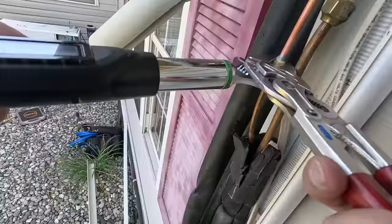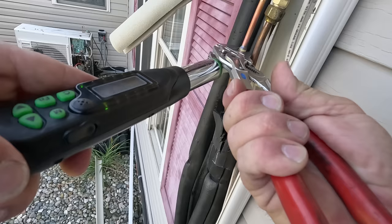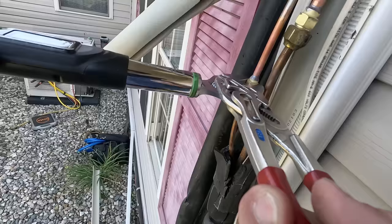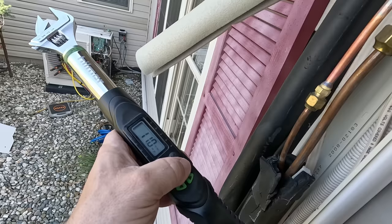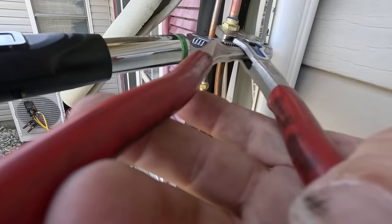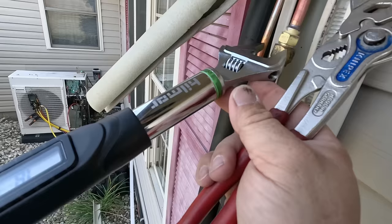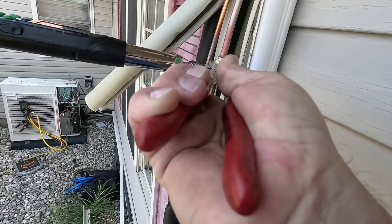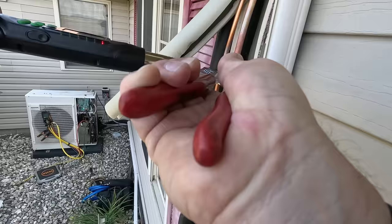There's five, there's ten — I didn't put anything on the threads. There you go, eleven. Simple as that. Now the next step up — 27 foot-pounds, supposedly, for three-eighths. You should be doing it like this with these. But these have got so much downward pressure on them that you can do it about either direction — it's obviously easier the other way. Getting close. She's not twisting any further, so we've got it. There you go.